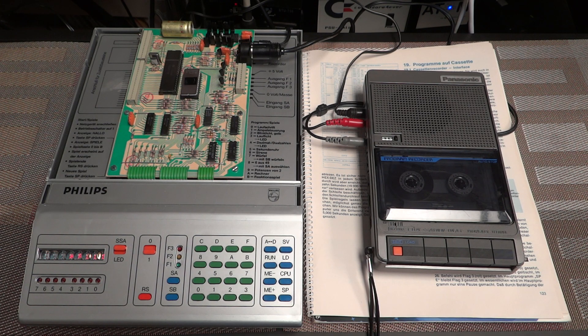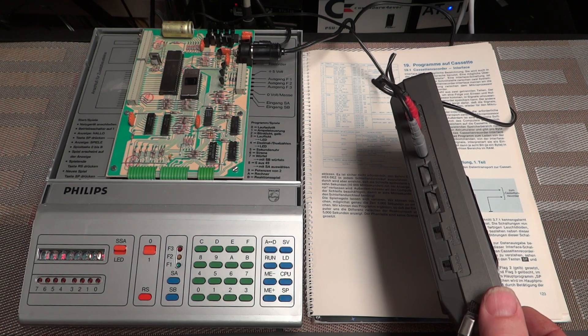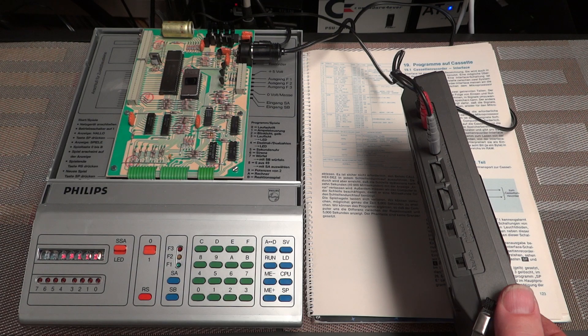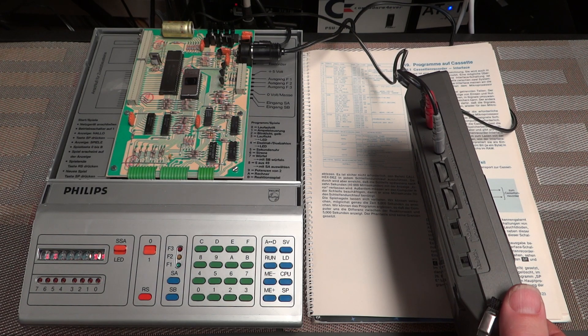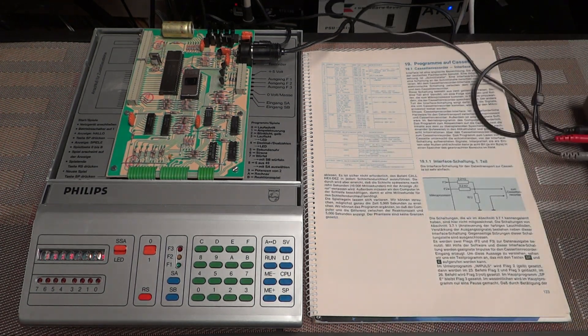So I'm going to demonstrate how you can calibrate your cassette recorder for this to work. One thing I'd mention before we start — the manual also mentions this — you really need to make sure that if your cassette recorder has a tone dial, you set this to bassy. You want to have as little high frequencies as possible, because the higher harmonics might actually confuse the interface: it might trigger and detect additional transitions and hence bit flips. You really want a dull tone, not a bright tone — it's essentially a low-pass filter.